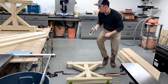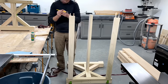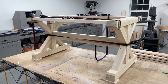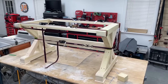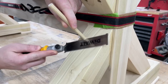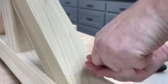For the second assembly I just hit the easy button to duplicate the first. When doing the dry fit adding the stretchers to join the two assemblies I found it to be a royal pain, so for the actual glue up I moved down to the floor where I could work with gravity to my advantage. By the time I added the length of the dowel sticking out, my longest bar clamps were just barely too short to work, so a good option is to just use some ratchet straps to pull the pieces together and clamp to dry. I added some double-up cardboard tape to protect the legs and prevent the straps from digging in and marring up the edges. With the pieces held together to dry, I got all those screw holes on the angled pieces filled with glue and 3/8 inch dowels. On a stained or natural wood piece this is a good opportunity to use a different species of wood as an accent or use a plug cutter so the holes have the same face grain. But in this case I'm just looking to make these holes disappear after primer and paint.